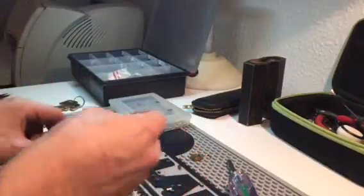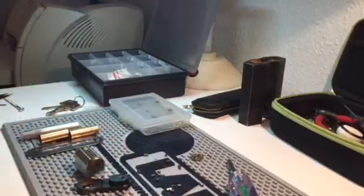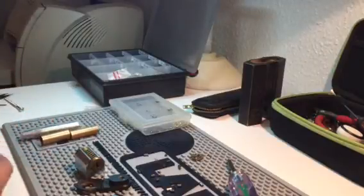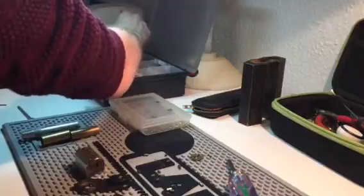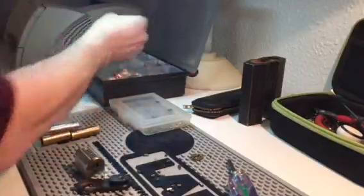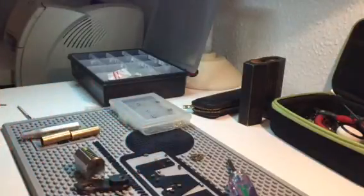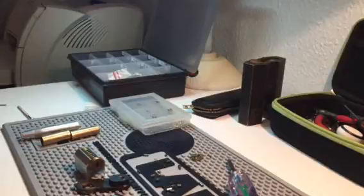So take our plug and put it in the plug holder so that it's nice and steady. Hopefully you can see it. And then we take our measurements from the key, and the first one is a 4 at the tip. With the Rukos, you start the numbering from the front, and the longest pin is number 1 and the shortest pin is number 9. So that's a bit back to front. The next is a 7.